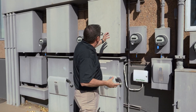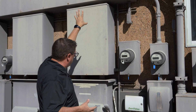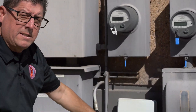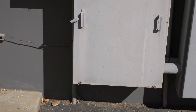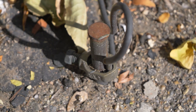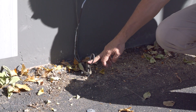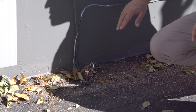In this case, I'm identifying that it goes up into this cabinet above and a raceway, but I have a solid ground conductor here coming down. And as I trace that, I find that I have a ground electrode here servicing that conductor. This is a buried rod, which I cannot verify the depth of, and they have a second conductor coming off of that, which goes behind me.